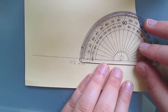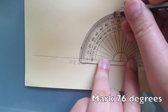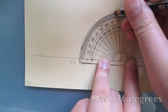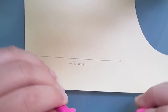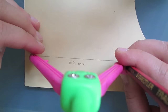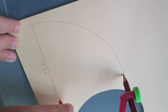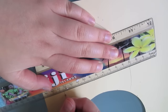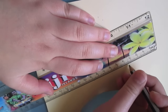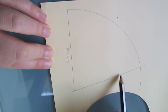It's time to make the cone template. Draw a line of 102mm, then grab your protractor and mark 76 degrees on the right side from the right side of your 102mm line. Then grab your compass, set it to 102mm, and draw this arc as shown here. Take your ruler and draw on your 76 degree mark with the baseline and with the arc line to create this sector.